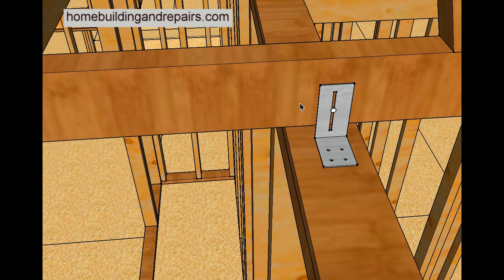As the roof is loaded — with all the roof tiles or shingles, air conditioning, and heating — it will cause the roof truss to settle or move a little bit. This is done before the installation of drywall, not after — that's very important. So the roofs are always loaded first, and then construction continues.